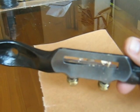You can see those shiny bits right there and on the opposite side. I've taken this spokeshave which was not working well at all, and with 50 grit paper — a couple of rounds of that and some 120 — I cleaned it up so that it's mostly flat. Took it to where it would be ridiculous to keep going. Also took out everything here, removed all the screws, and used these files to flatten out the surface inside. This is a really cheaply made spokeshave and it was not working well at all, but I want to use it — that's why I bought it. So I trimmed it up a little bit.